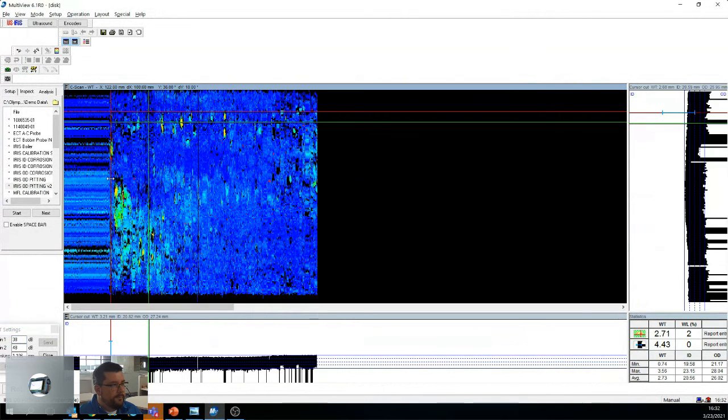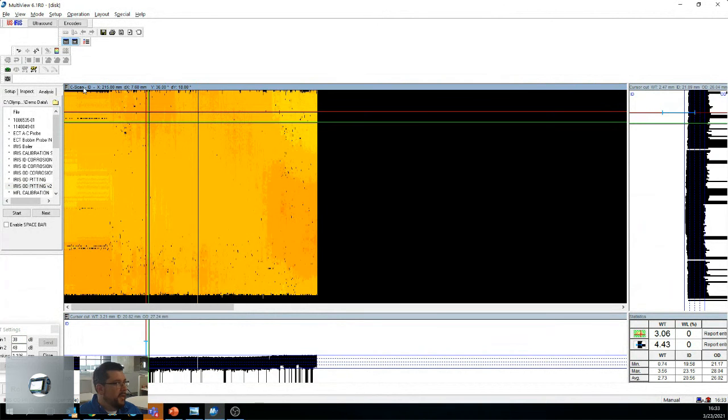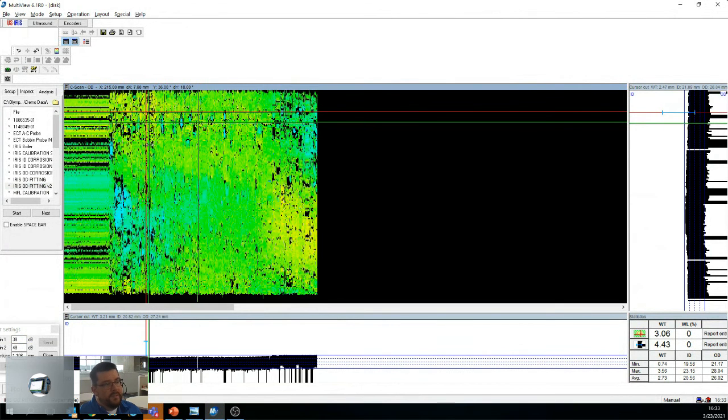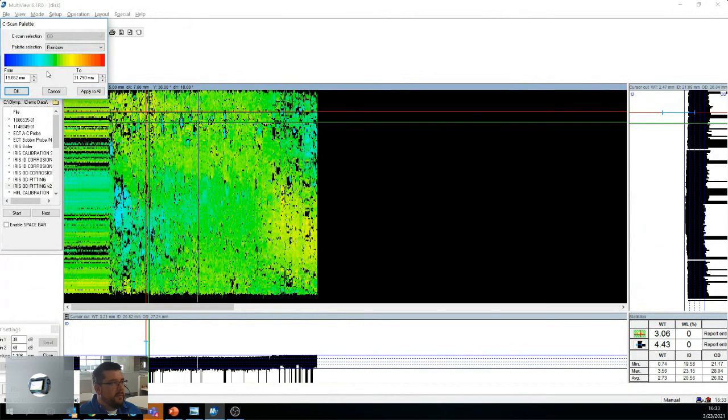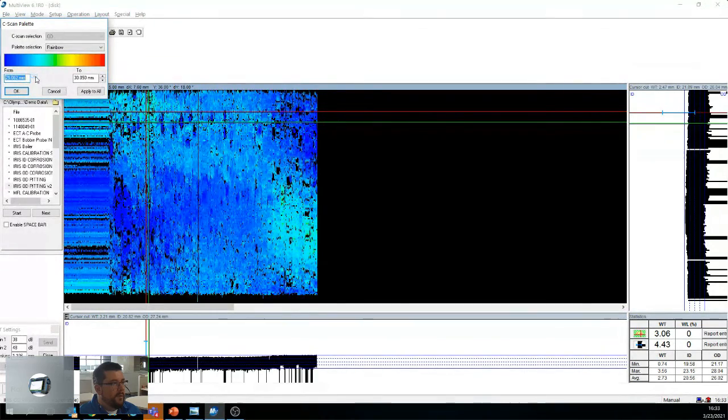Same here. So we got a lot of OD pitting here. You also have different views. You have the OD view, you have the ID view. So really nothing on the ID. The wall thickness is basically OD minus ID. And the other one is just what we see on the OD. So see all of that. We got different options here to change the color palette and all that. Depending on what you want to see, you can modify it and so forth. Okay.